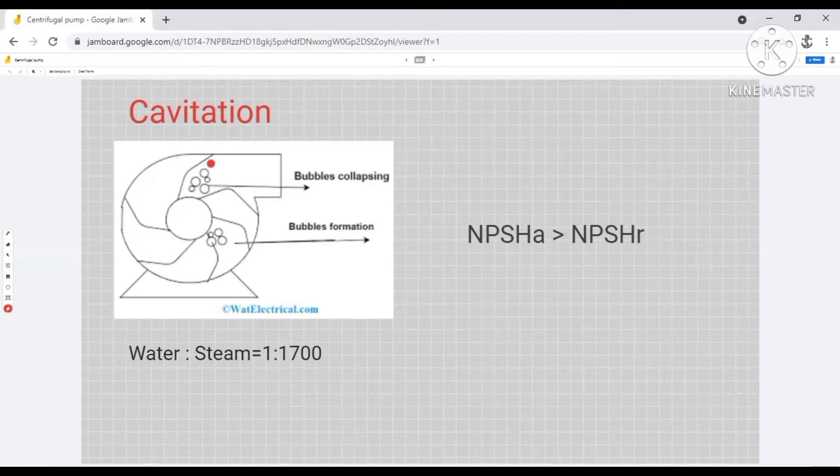When the bubbles reach the high pressure side, the pressure is no longer as low as the vapor pressure of the water — the pressure has increased. So the steam will return to its water state and the bubbles will collapse. When these bubbles collapse, they form a shock wave that creates a pitting action. You can see pitting marks, and these are checked during a regular inspection of the pump. This is what cavitation means.